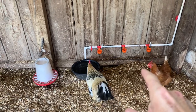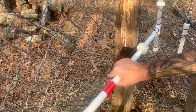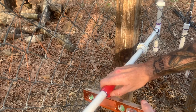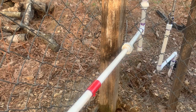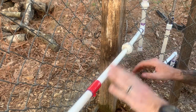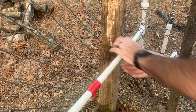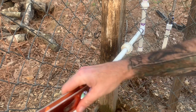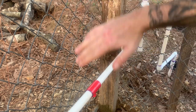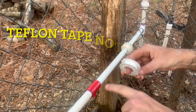I want the unions close by for this reason: I want to make sure these nipples are pointed straight down and plumbed. By loosening this union and that one, this pipe will roll. So if I wanted them straight out like that, you put your level on there and get them level. Here's the exact same system — if this is inside our big coop, you see we use the cups here, but that's not the application I want. I want it to roll straight down. Put your level on there, get it level, then tighten this down without moving the pipe since you've already got it level. The pipe itself doesn't have to be perfectly level — it can go up and down, as long as it doesn't go above the bucket you'll have water to it.